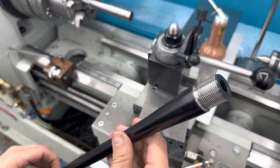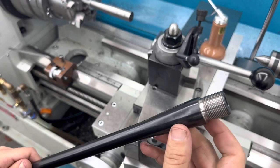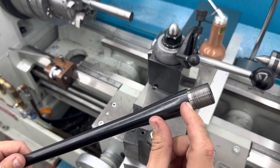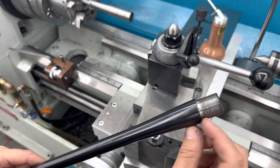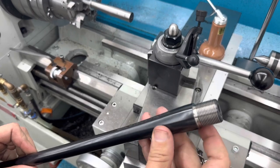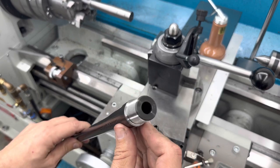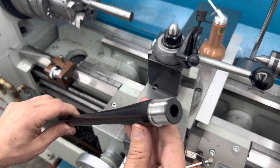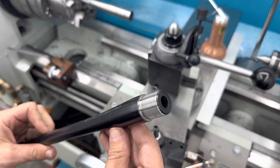This tenon is as extremely straightforward as it could be. The bolt from the bolt face to the end of the receiver is one inch ten thousandths, so we'll cut this one inch. The threads are one inch in diameter, 16 threads per inch — pretty brainless. We have no chamfers, no angles, nothing whatsoever here. So this will be a pretty straightforward tenon to cut.